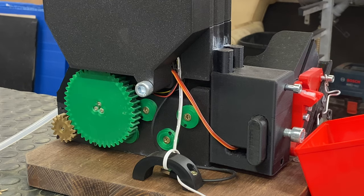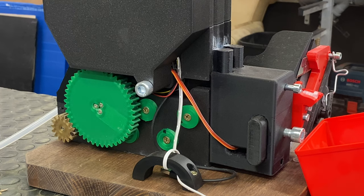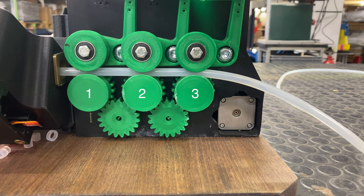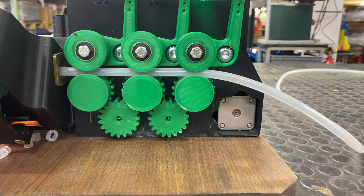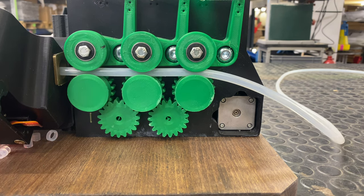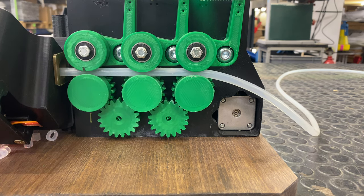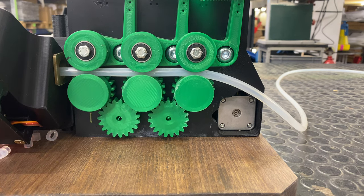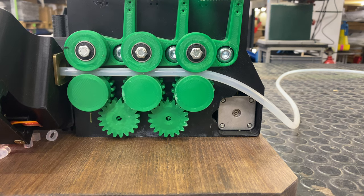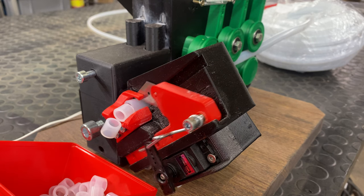Here, for example, that's the gear train on the back. The little golden gear drives the bigger gear and that transfers the force to the front of the machine where all the other gears drive each other, so it's three-wheel drive. I had to make a few tweaks to this gearing because it wasn't powerful enough at the beginning, but now it works absolutely flawlessly. These gears cost maybe a euro to print, versus buying them made from steel or plastic at about 10 euros each — so that's 50 or 60 euros just for the gears. And when you buy gears it's always difficult to attach them to a shaft, whereas here the 3D printer just prints them all in one piece.